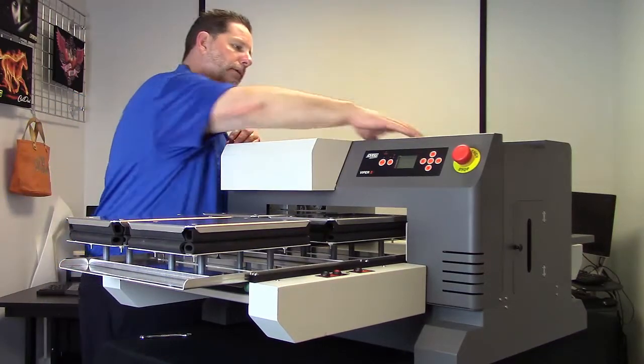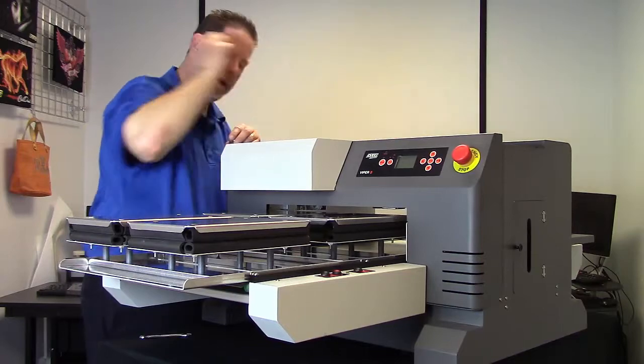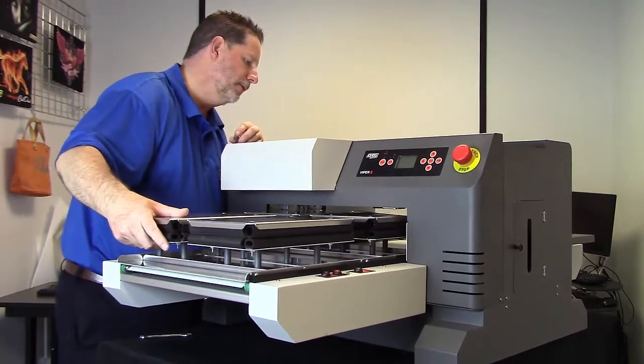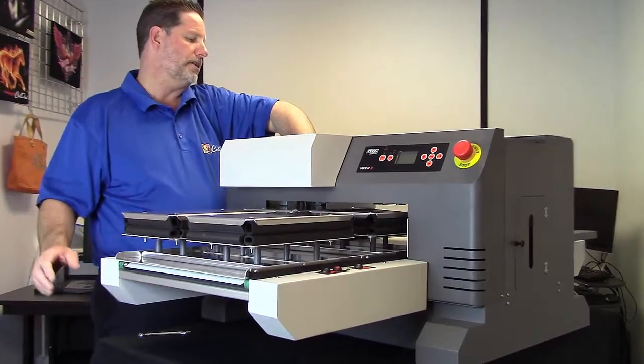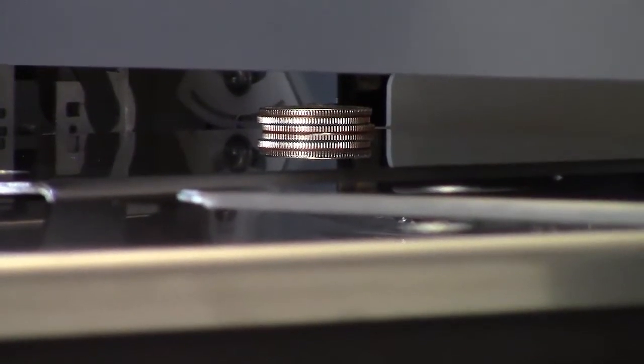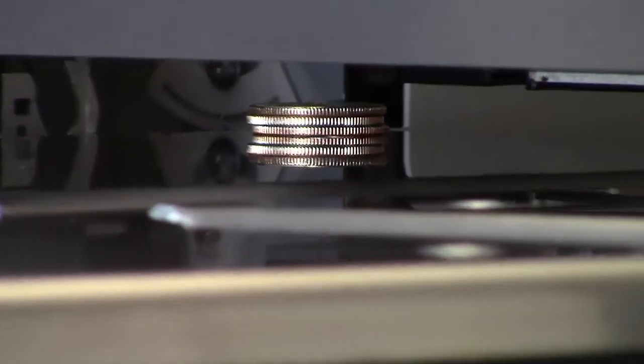And now I'm going to bring the printhead over, and I'm going to manually push in the platen by hand. And I'm going to set a stack. I happen to be using 3/4. Again, the height is completely arbitrary. You just have to make sure that we use the same device to check the height everywhere.